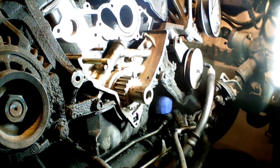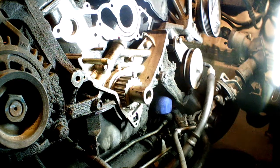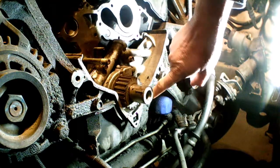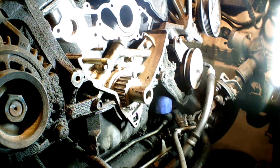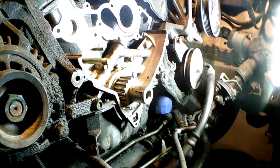There are some very vital things I forgot to do. Looking at the Haynes manual, it says there's a mark along here somewhere — there's a mark right here on the timing belt sprocket, but there is no mark on the oil pump housing, and that is most vital. So I'm going to put the cover back on with just a couple bolts because it's got the timing marks on it, and then I'm going to put the harmonic balancer back on.